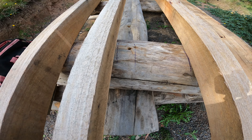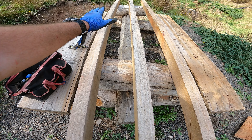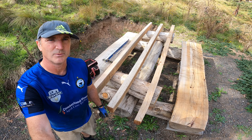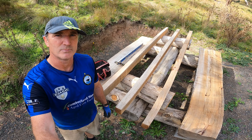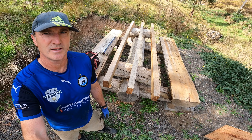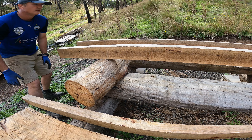So today what we're gonna do is get the chainsaw - I've marked on there where the cuts need to be. We'll get the chainsaw to cut down here, remove this piece of wood and then this will drop into the gap. I'll do the same for one, two, three pieces. I'm going to ensure that they're level that way and level across, and then that's going to give me a frame for the tabletop pieces to go on to. Once we've got this frame in place we'll drop the tabletop pieces on and using a circular saw or the chainsaw we'll cut them to length and nail them or screw them in place, and that'll be this bench finished. So let's get the chainsaw fired up and have a go at getting all these pieces put in place.